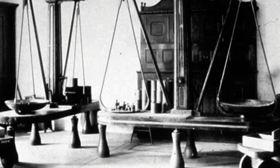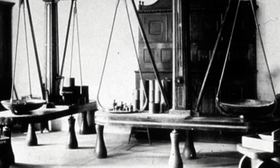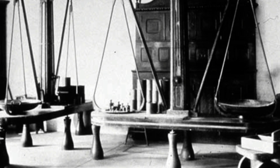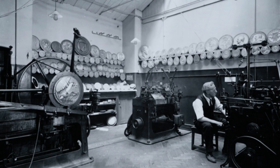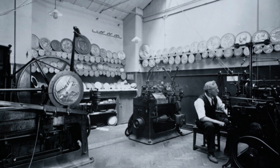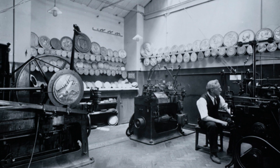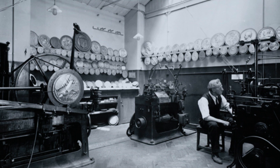The silver, mixed with copper, is run into vats on a lower floor, and is purified and granulated, when it resembles pipe clay. The granulated gold and silver are pressed into large cheeses in a hydraulic press. A cheese of gold, 12 inches in diameter and 3 inches thick, is worth $20,000. A silver cheese of the same size is worth $900. The sulfuric acid, after it is used, produces a sediment of blue vitriol, which is much prettier than either the gold or the silver seen in the assay office. The vitriol and the weak acid are both sold for as much money as the original acid costs.